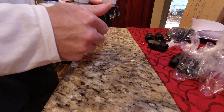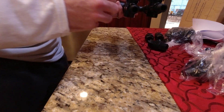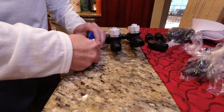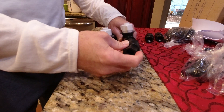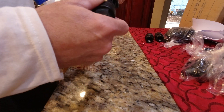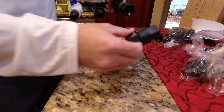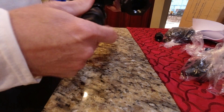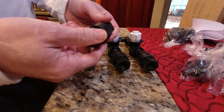You run some more nipples here, and then you've got check valves — half-inch check valves. You can see an arrow on them. You want the arrow facing toward where the pump is sucking. You can put these before or after the valve — it doesn't really matter according to my research. The point is you don't want anything to flow back and cause contamination in either tank.